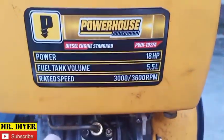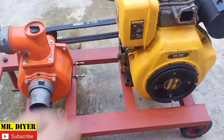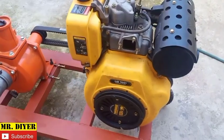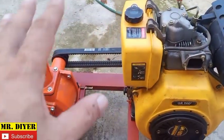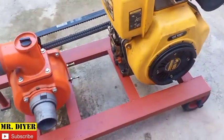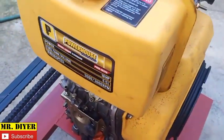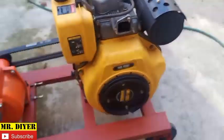This engine is a diesel engine, air-cooled, actually 18 horsepower. Why I opted for a much bigger engine: I generally needed a water pump as well as a generator. So I figured instead of buying a separate water pump and a separate generator, I might as well make a two-in-one machine — one engine with a water pump as well as a generator. I intend to buy at least a 7.5 kVA or maybe 10 kVA generator, that's why I opted for a much bigger engine.